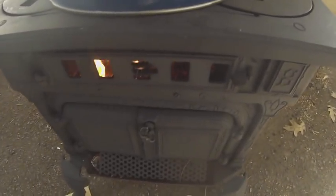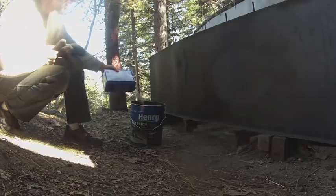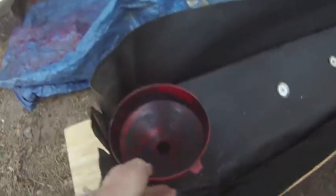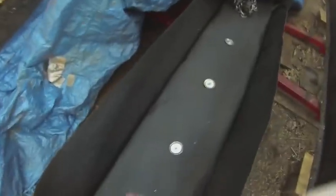I've had the wood stove going for about an hour, thinking I could heat the roof tar to a liquid, but it's not working. So I'm trying paint thinner next. It's pretty liquid now, which is good — hopefully it'll flow better and fill in what the epoxy tar did not. About half a gallon of paint thinner per gallon of tar makes it flow like that, and hopefully the epoxy tar will be the base over which it spreads.